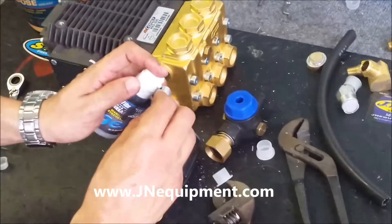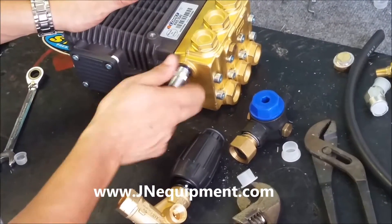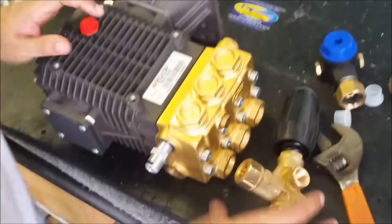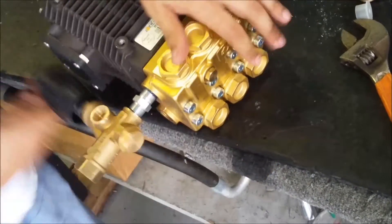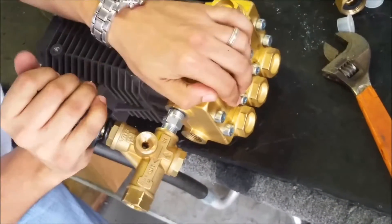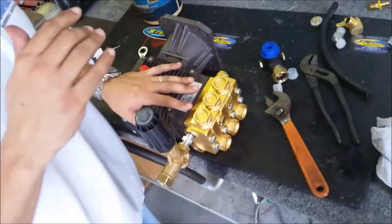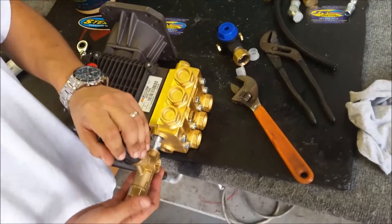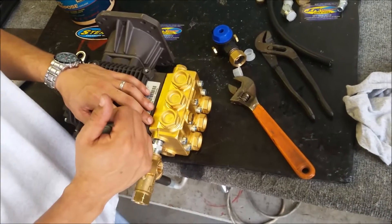My trick to doing this: a little bit more thread lock, put this in by hand, then put a little more on this side. Making sure my direction is correct — in, out — I'm just going to thread this on. As I tighten this up, the entire adapter in there is going to spin, thus tightening it up. Give it a few turns — that feels nice and tight. I like to make sure it's pointing straight up and down. If you have an unloader without an easy start valve, it doesn't really matter which way it points. But if your unloader does have an easy start valve, it must be in an up and down position — if it's sideways, it might not function properly.